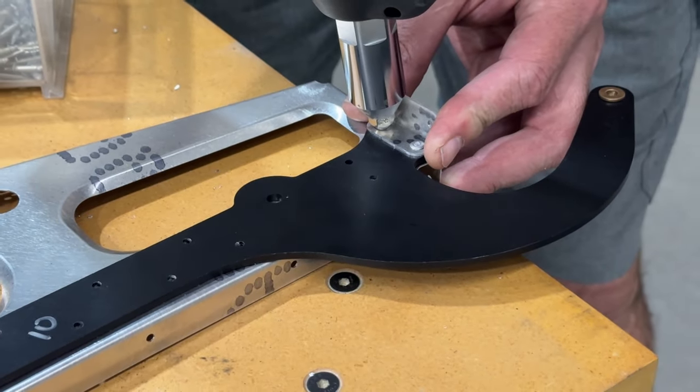Here's a little detail work — the flap bell crank with the Teflex mount and just a little safety wire. On the safety wire, I looped it through and did a double spiral wrap like you might do on a turnbuckle — wrapped it around once this way, the other end wrapped the other way, then twisted it at the top. I felt that was a little more secure. I did something similar at the crimped-on fitting on the control cable — went around one way, around the other, then twisted.